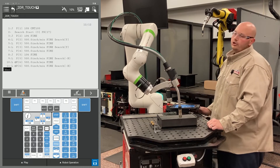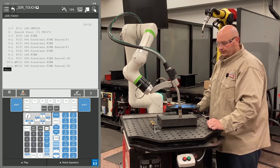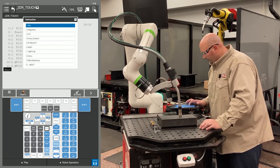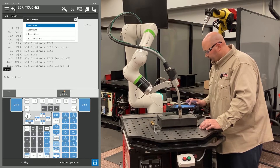A 2D with rotate requires two searches in two different search directions. I have two in the Y and I have two in the X. I'm going to tell the robot to stop searching — press F1 instruction, go to an option called touch sensor, and select search end.